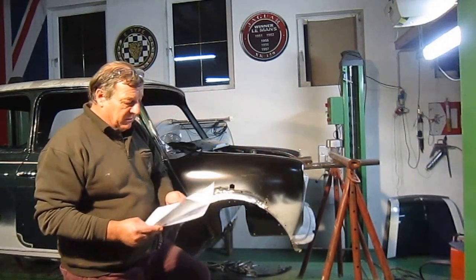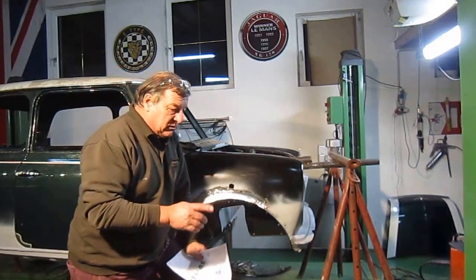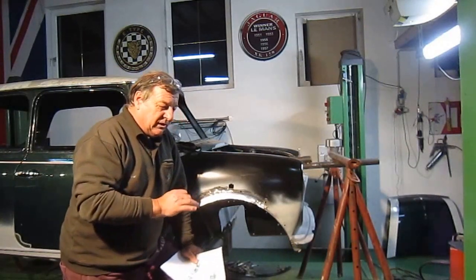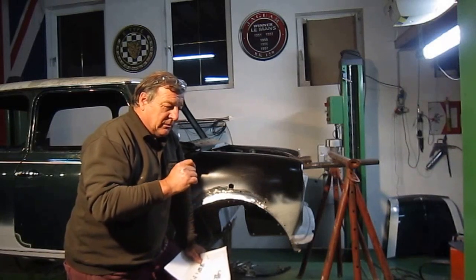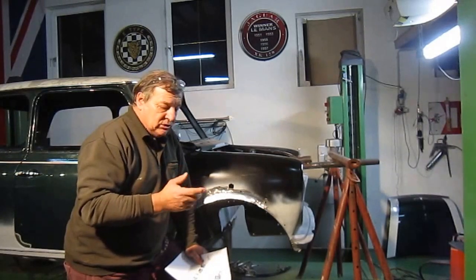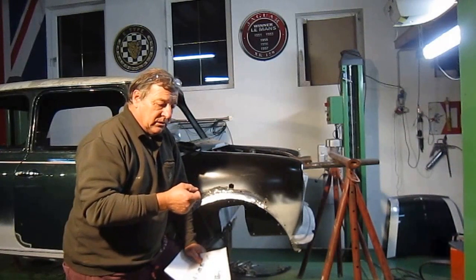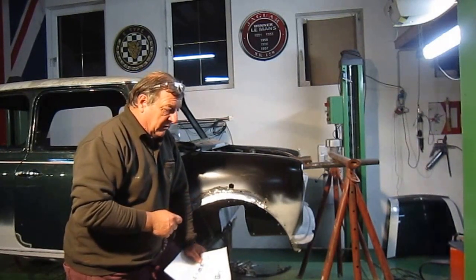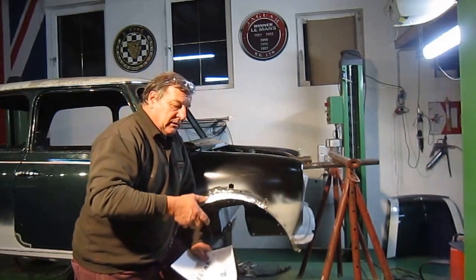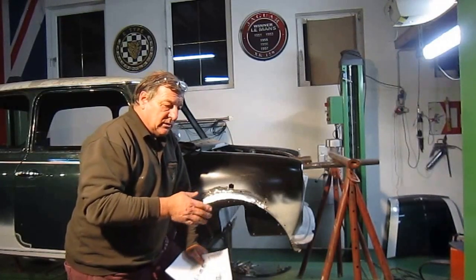So I've got it here. What it is — it's the same kind of machine. The machine I was looking at first has a pistol spot welder, but it's really only good for aluminium and up to about one mil gauge, or maybe 22 gauge steel. If you've got two thicknesses or want to do something a bit thicker, like one and a half or two mil, then it's a problem. So I've decided to upgrade to a better machine, which has a hand-held spot welder, but this device also has a lot of other things.